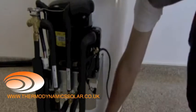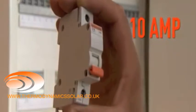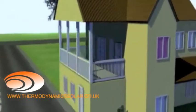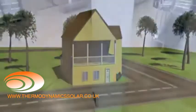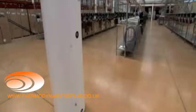The electric supply should be 230V 50Hz single phase, carried out by a cable provided with the equipment. The electrical supply line should be protected by a 10A thermal magnetic circuit breaker or by an equivalent fuse. The water heater can be placed in different compartments such as the garage, basement, pantry or attic. It is equipped with a magnesium anode, an outlet for hot water, a drain point, a cold water inlet and a grounding connection.